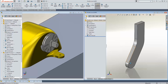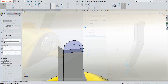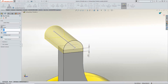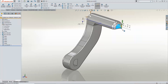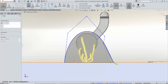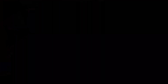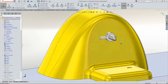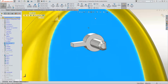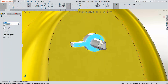Nothing tricky here — just sketching. A little polish on the handle and it's looking good. In SolidWorks we can make sure it's right the first time. The movement's now clear, and I don't see this getting drastically different, so I'm going to get the handle print started. The last design element is to create the mounting supports for the switch. Using a true top-down approach, I'll define the necessary geometry by referencing the switch model directly, ensuring a perfect fit.